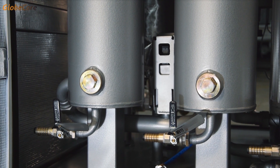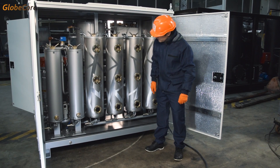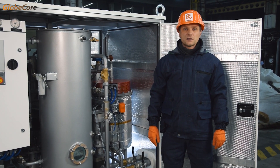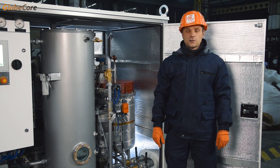The accumulated water must be drained from time to time. The amount of extracted water can be seen in the filter's side glasses. Depending on the actual content of water in the oil, the operator can engage or disengage the coalescing filters.